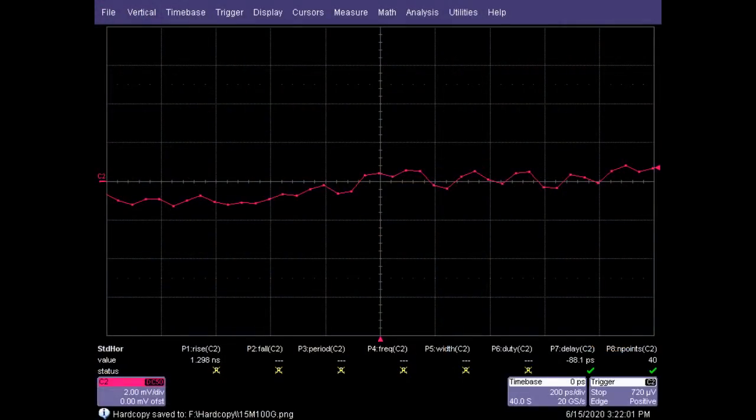So early on, I took the 13.5 gigahertz oscillator, I attached it directly to my LeCroy 8500A. Again, that scope has an upper bandwidth of 5 gigahertz. There's nothing that suggests that the oscillator is actually running. Apparently 13.5 gigahertz is just too fast for the 5 gigahertz DSO.